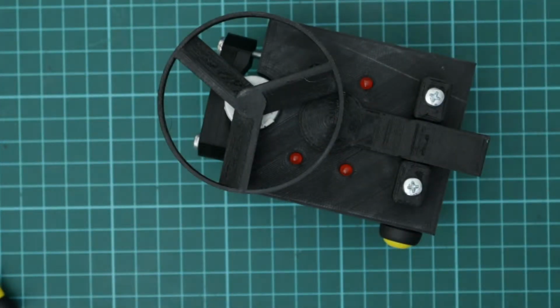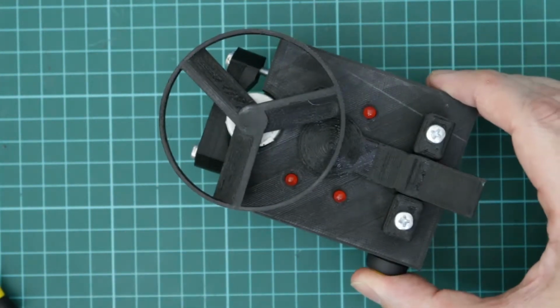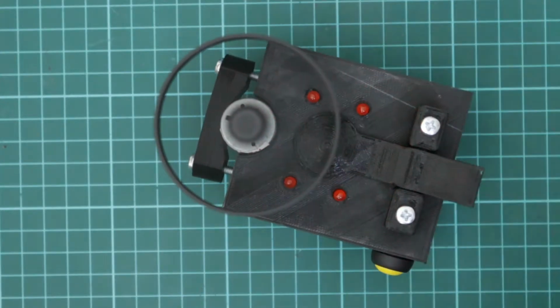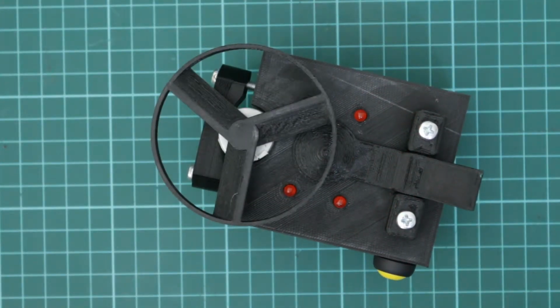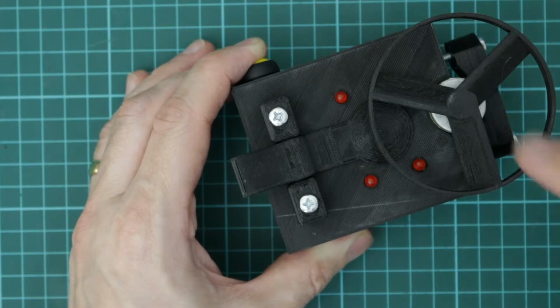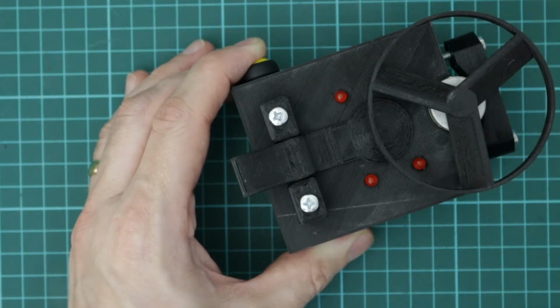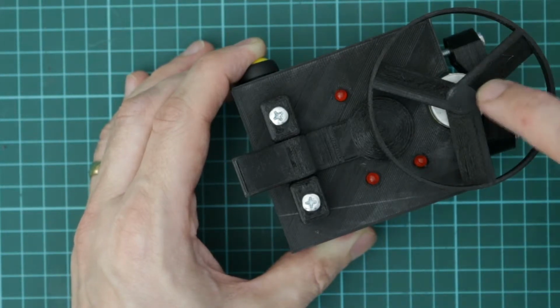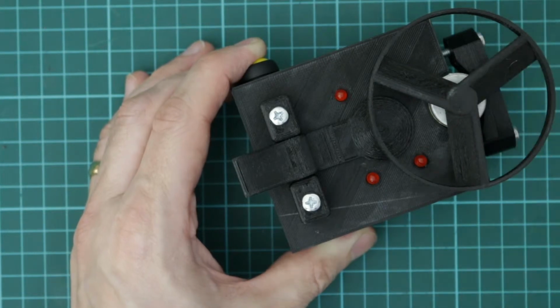I'm ready to give it a quick test. So it's looking good. It would be quite good if I'd worked out how to get this to come off without having to press the lever. It may just be that this isn't spinning fast enough, or need a slightly different blade design, or just somehow reduce the friction between the fan blade and the shaft adapter.